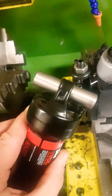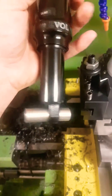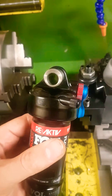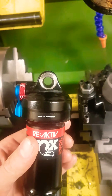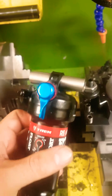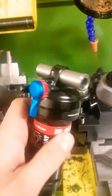I've just machined these — they're made out of stainless steel. That one does actually stick that far through; it's the design of the linkage, and it is right as it is. But even though it's a 10mm bolt, we've got more of an offset and he's going to drop about one and a half degrees on his head angle with these. The outer diameter has been machined to 15.07 millimeters across the entire length. Happy days.